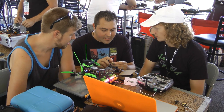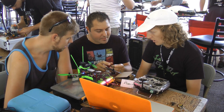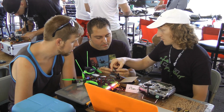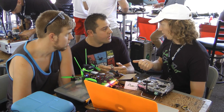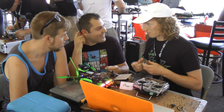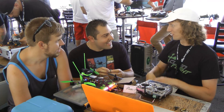I've noticed you've got PWM pins on here as well as breakout cables — is that for using either/or? No, they're different functions — these are the outputs and these are the inputs. So you can have eight PWM in and eight PWM out. If you want, you can run an octocopter, or you could do an X8 mini. I'm going to be building a 180 X8 combo — that's going to be very cool.